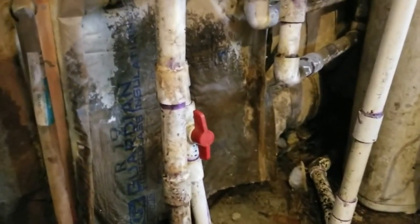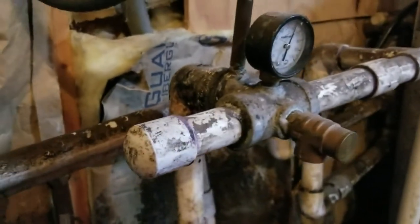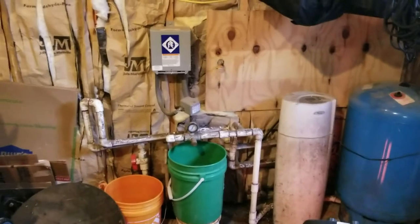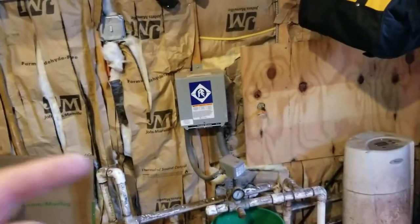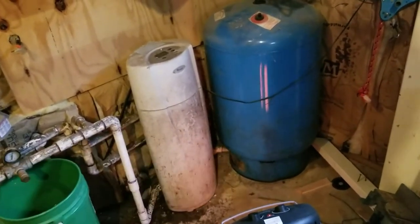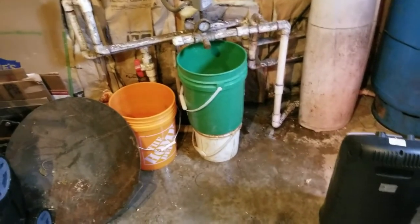It's all wet right here and it looks like that's where it's had problems before — coupler, coupler. For those of you new to wells like me, here's what I figured out: there's a reset button right up underneath this box. It's building up pressure and shooting it over to the pressure tank, but the line right here is still frozen, so it's blowing out the pressure relief valve and spraying all over my floor.